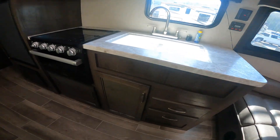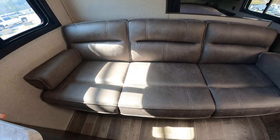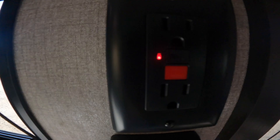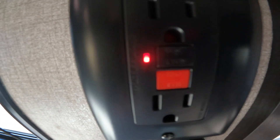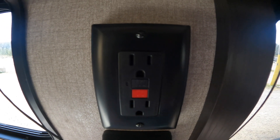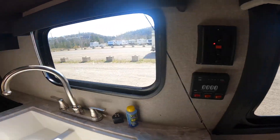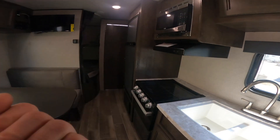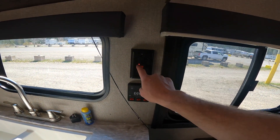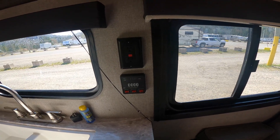As we come back to the main area, we'll make note of your sofa. This sofa does fold flat into another usable sleeping space. We'll also take a look at the unit GFCI. If the plug has been tripped, you'll see the red light come on, indicating it is not functioning properly. You can reset it by pressing the top black button and the red light will go away — the plug is now functioning properly. If this GFCI has been tripped, any plugs near water — the counter plug, any plug in the bathroom, or your outside plugs — may also stop working, as they are likely on the load side of the GFCI. When you press reset, all of those receptacles should function properly again.